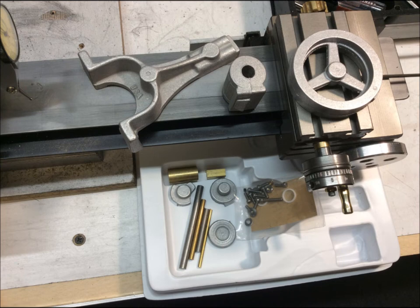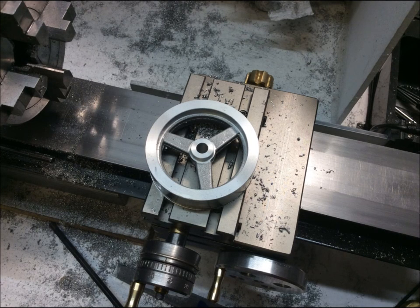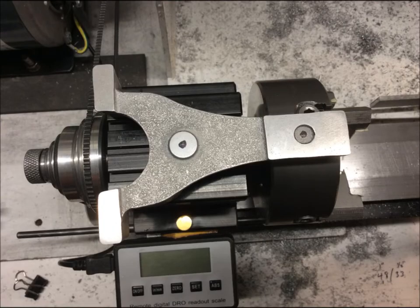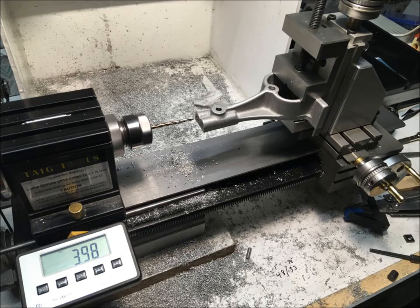I started with the flywheel because I've never machined cast aluminum, and this part should be pretty straightforward. On this slide you can see the limits of milling travel using the lathe with milling attachment. Milling the frame required about a dozen individual setups that could have been accomplished using only three or four setups on even a small hobby mill.